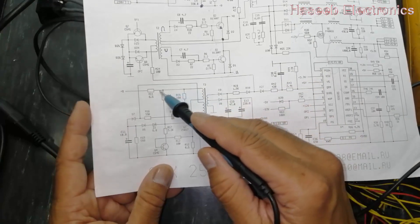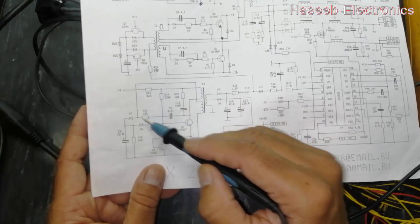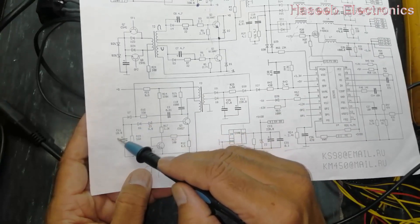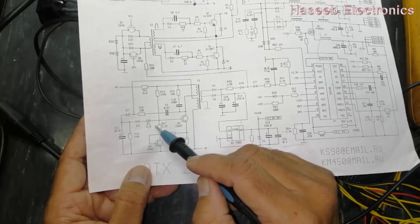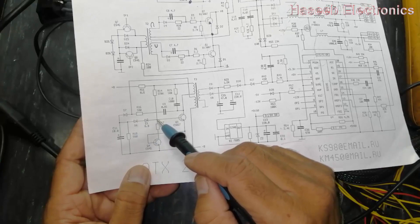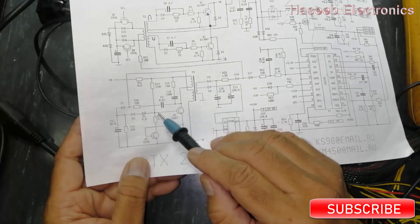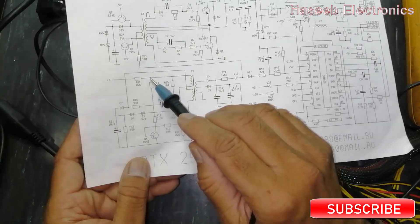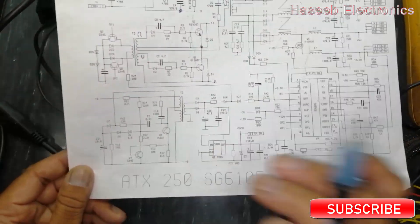Meanwhile, we are taking voltage from the VCC winding. At this diode, it will cause this capacitor to charge. A bleeder resistor, one diode, 6.8 volt Zener diode, and a series rectifier will provide a biasing voltage to this transistor base. This transistor will keep the voltage to turn on and off this transistor. These startup voltages are for running this transistor, so our circuit will work in this way.